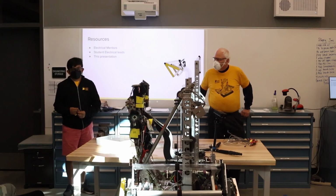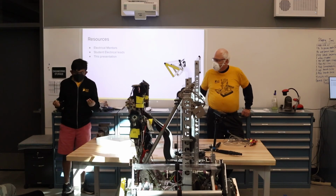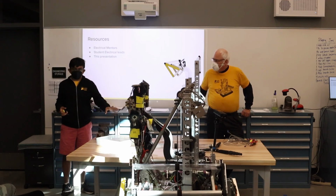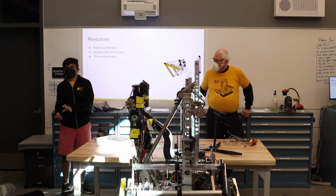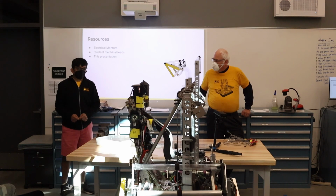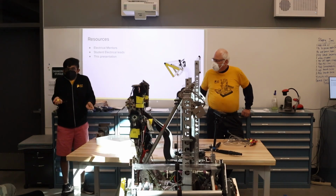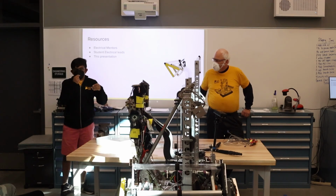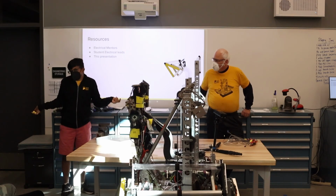If you combine that with the rest of the localizer using the IMU and past data, it becomes even more precise. If you guys are familiar with what a Kalman filter is, in this case, our IMU is our noisy but higher frequency sensor. Our lower frequency sensor, but much more accurate, is our camera. The other thing is that we also had a really nice system for our Pis, so they could already interface with the light that we made, and it just works.